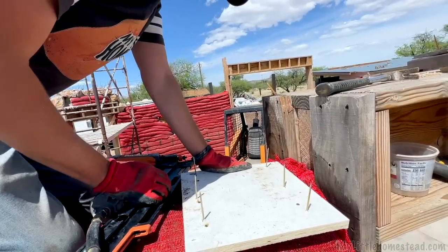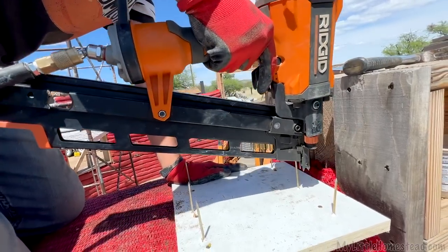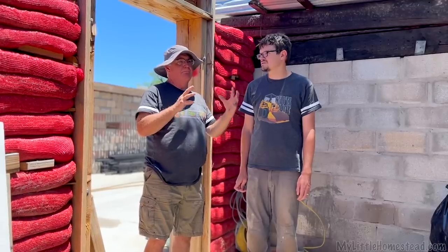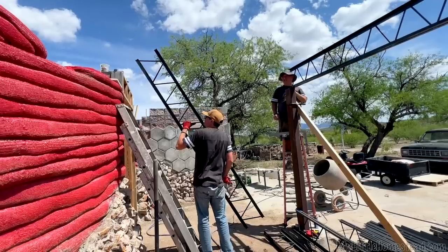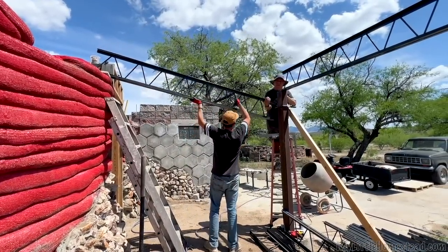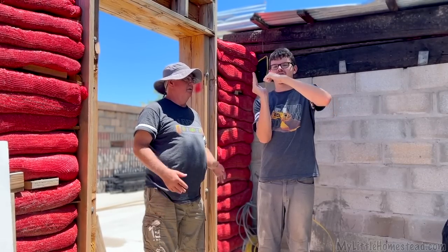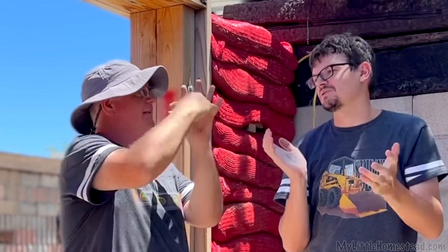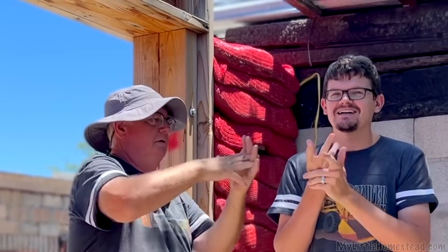Bingo. It's a lot less work using this direction, I think, than when I wanted to put in backing and then attach bolting on things. That's a mess. That's much stronger using this method where the actual beam is tied into the wall as opposed to tied to the wall. Instead of being like this, it's more like this. Right to the wall. My fingers are stuck.